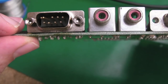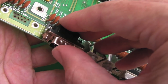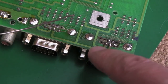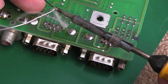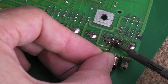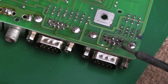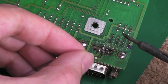So the choke - the points here are actually for the power connector. One or two of those pins are a little bent but it's going through. There we go - it's going to be raised up a little bit. This one's annoyed me - that's brand new. This is one of those connectors from Amiga Kit - the pins are pretty bent on the things even from new. I've soldered to the bits of pads that are there, scratched off these traces a little bit, and I'm going to reinforce them with kynar.